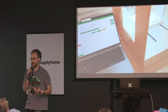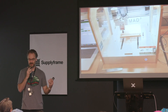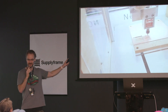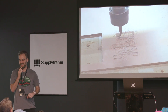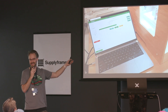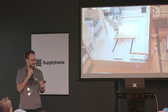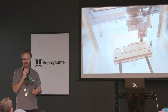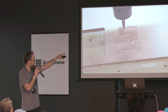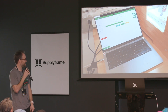Dave mentioned this — in my day job I work at a nonprofit in Boston called The Possible Zone. I teach students how to make circuit boards, how to solder them, how to run CNC machines — I'm a senior technician. I have a fleet of lovely little mills. This is from the summer — I did a workshop on dance and electronics. I was designing the board the night before, and when you do that, you can just mill the boards and have them ready the next day, which is really fabulous. With circuit board milling, you're really restricted in the components you can use — SOICs and DIPs are pretty accessible, but anything smaller than that is difficult. The milling cutter runs slowly, makes dust, makes noise — it's just not very pleasant.